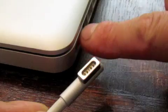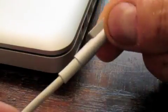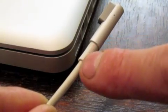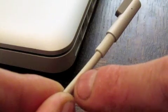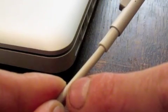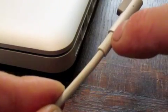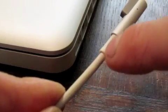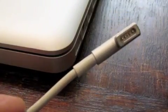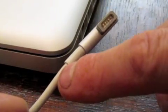So I've looked, I've cleaned everything, I've checked the little pins, and that all seems in good order. So the next stage is, I'm going to slice the sleeving here with a blade, and I'm also going to slice the cable outer sheath to reveal the inner cables. Hopefully I'll be able to find out if one of those is broken, and possibly then repair it. This is the first stage of the repair job, and if I can find a cable that's broken here, I can usually repair it.